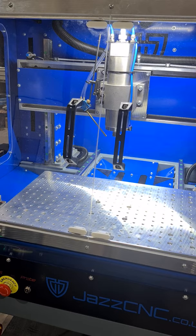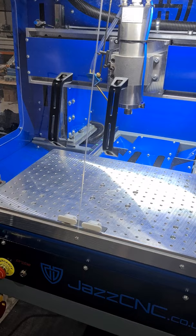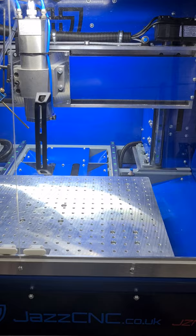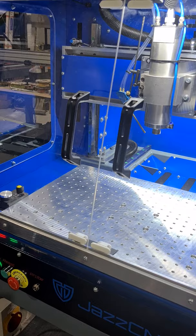It's a fast machine. We've got it programmed to 15 meters a minute — it will actually do more, but we've set 15 m/min on X and Y, and it will easily do 20. The Z-axis we've deliberately kept at about 8 m/min because it gets a bit scary. You've got all the usual homing and limit switches; it homes to the back-left corner.